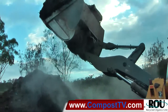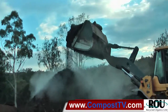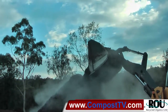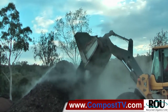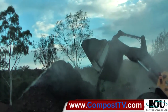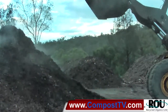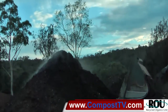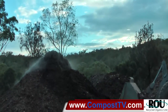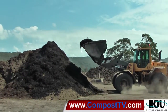We're lifting up the material and let's see what he's going to do with that. As he's putting it down, he's not putting it all down at the same time. He's letting it cascade out of the bucket and roll down the front of the pile. What that does is it helps the material break up and loosen, and better aerates it, better mixes it, keeps it looser.